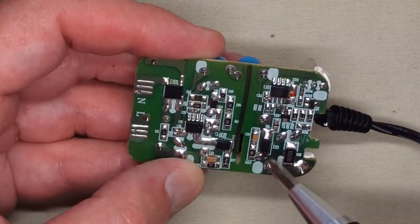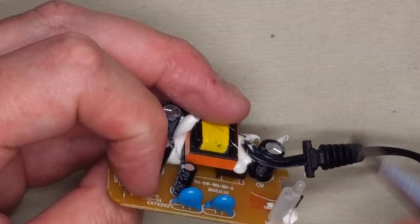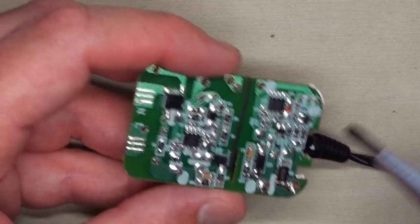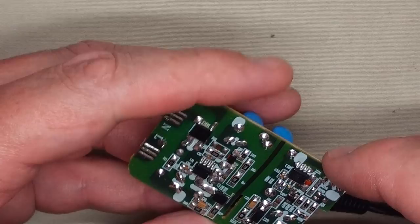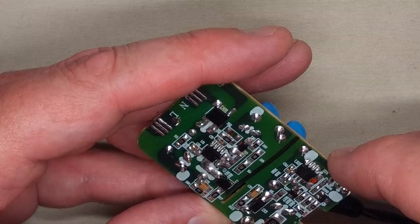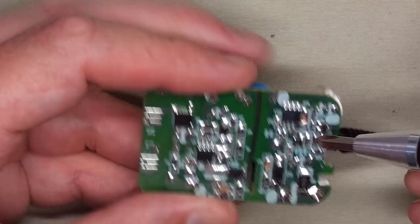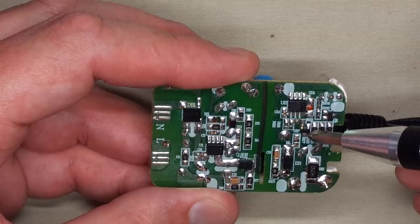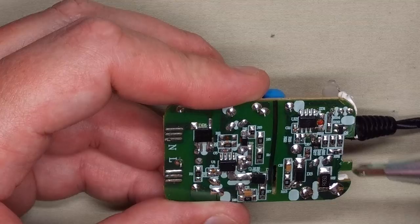The output diode actually has a capacitor and resistor across it. This chip turned out to be an LM358, which is a dual op-amp — I think that's purely dealing with the changeover of the LED indicator. There's no feedback from the secondary side to regulate the voltage. To limit the current output there is a big fat resistor — R050, 0.05 ohms. And there's a 431 voltage reference chip, just with the two pins shorted together so it produces a standard reference voltage, and then dividers and resistors based on it.